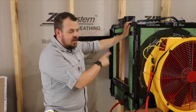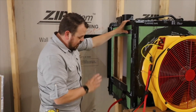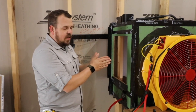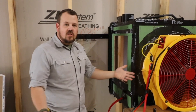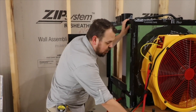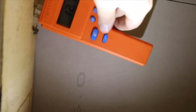No water through the seam that's on the other stud. We really feel like this performed well. We're not seeing any visual water inside and we're not seeing any visual water lower in the wall. We know that between the polyiso and the zip sheathing we're not getting any leakage there because it goes down and connects to the plate and it's taped at the bottom — it would have to show up someplace in here if it were leaking. We also took our moisture meter and tested before and after on the studs right up against the sheathing, and we're not getting any different reading — still at 12.5 or 12.1 percent moisture.